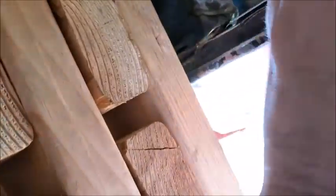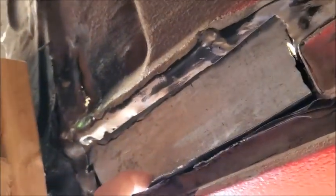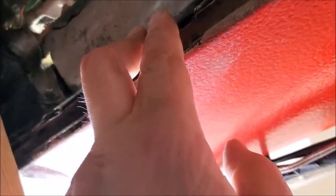But like I said, I am going to fiberglass this. I think what I'm going to try to do is tack weld just here. Just drill some holes through this and try to maybe just tack weld here, like 10 little tack welds to hold that on. But at least then it's just not as big of a hole. And then also the fiberglass has something to hold on to, because that was a pretty big hole to try to fill. So it'll be a lot easier to just place the fiberglass, and I'll probably do it this way to shorten the strands and get it all good and sealed up, and I'll seal it from the inside as well.